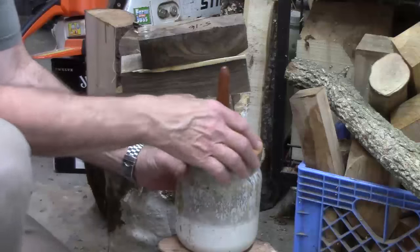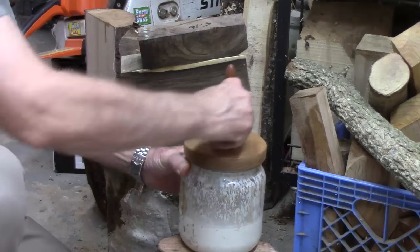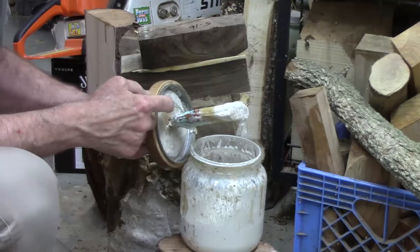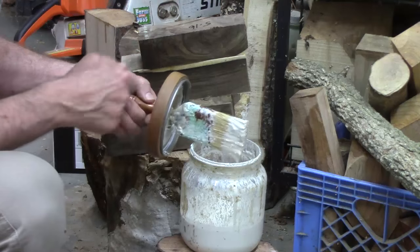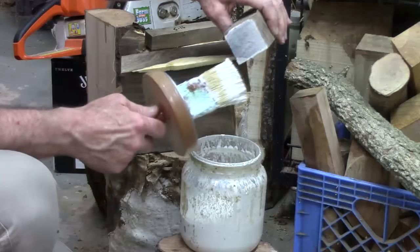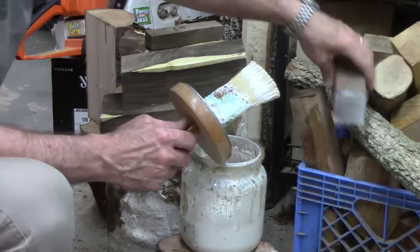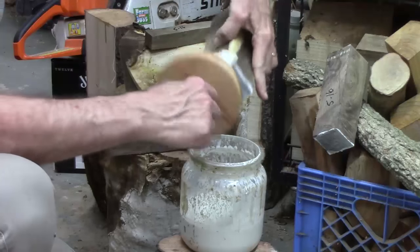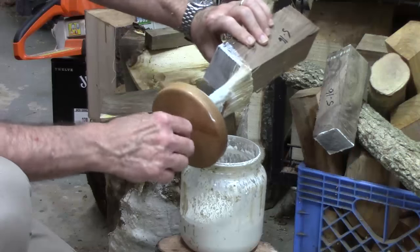Here's my handy dandy anchor seal bottle. I think this is a big plastic peanut butter jar or something, but I made a lid with a recess in it that fits the plastic lid, and I fastened a brush on it because this stuff never really dries — it goes back in there and stays soft. This works pretty well to temporarily or permanently treat spindle stock by coating both ends with anchor seal. It just makes it real handy to open up the bottle and dab it on there — you've got to try to get a little bit around the edges too.